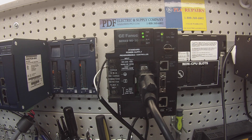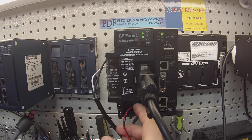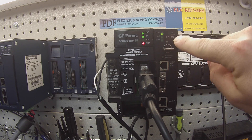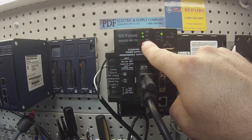Another quick example about the battery: what you need to know is if you potentially need to replace the battery — if you have a battery light that comes on and turns red, that means the battery is either not connected or the power it's giving out is too low, basically a dead battery. It's going to give you a warning light, and that's the red light. When the CPU is placed into run mode, the green LED to the left of run will turn on.